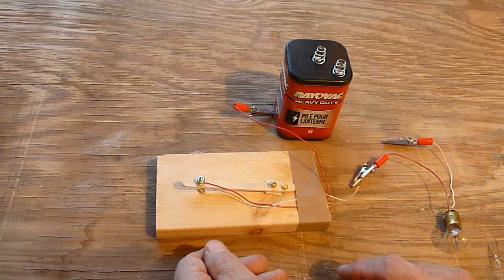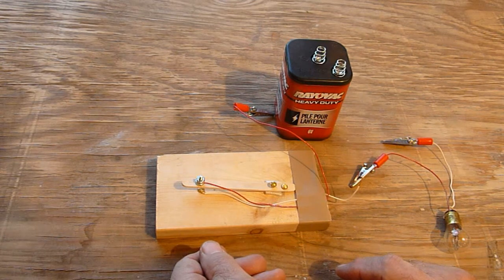This may be hard to believe, since it seems that light appears the instant you turn on a light switch, which it does. Obviously, there must be more to electricity than simply moving electrons, and there is. It is electric pressure, which is something like water pressure, only it deals with electricity. Like water pressure, which pushes the water molecules through the pipe, electrical pressure pushes the electrons through the wire. This electric pressure travels at the speed of light and its intensity is measured in volts. This electric pressure is usually called electromotive force, or EMF, and is part of the mystery of electricity.